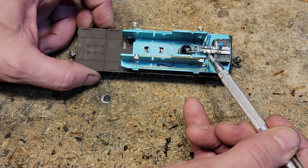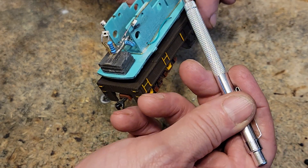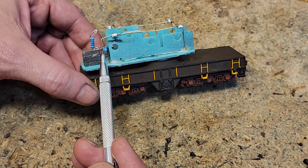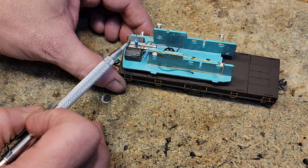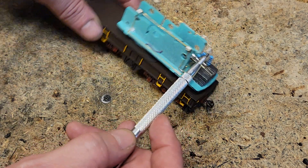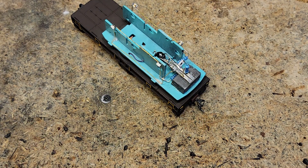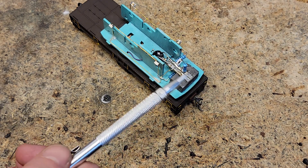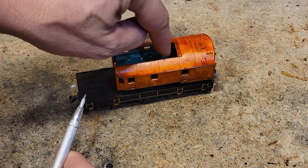So it comes in — this tells me which direction to go with the wiring. I take some of this copper wire and bend it into shape, hold the shape, a little super glue here and there, bend it, attach an SMD, attach another piece of wire, drop the glue, SMD down, resistor bends around the back side and up to the PC board on the other side. There's a little copper piece of wire there that goes down, comes around on the floor in the back, then up to the SMD. Out the SMD to the resistor back there, then the spotlight. This is the interior spotlight.